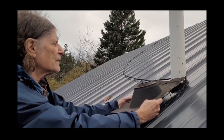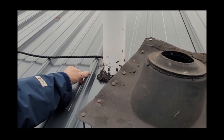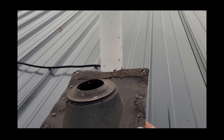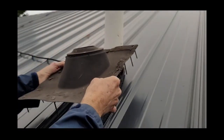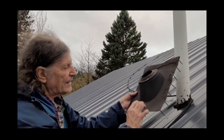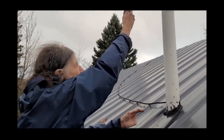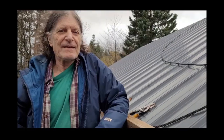You can see this will have a bit of an interference along this particular ridge. What you could do is trim this edge down so it fits right in this little valley, and same thing over here — trim this one straight to fit into this valley. When you drop it on, put a real healthy bead of silicone or acrylic silicone caulk, put a bunch of that on, drop it on, then use your roofing screws to screw it down. It's that simple — slips over, screws down. So that's it, that's how you do it.